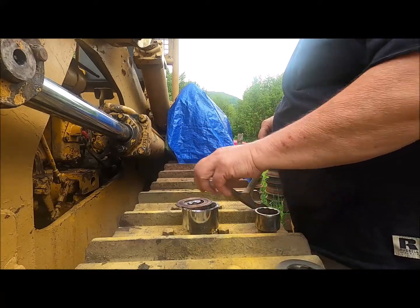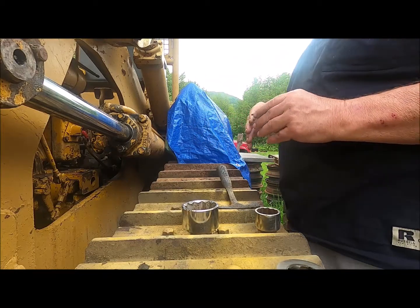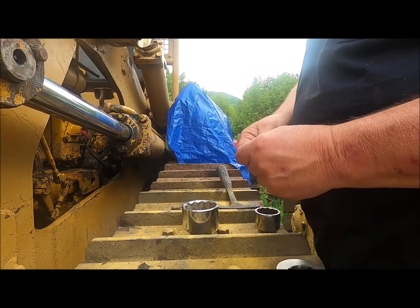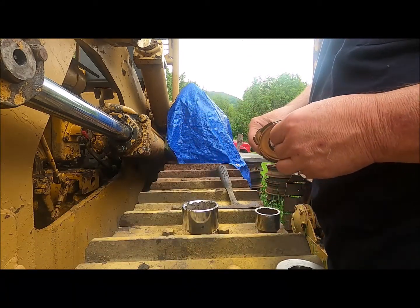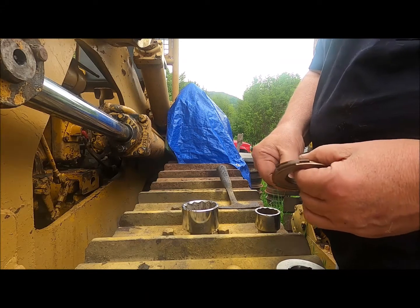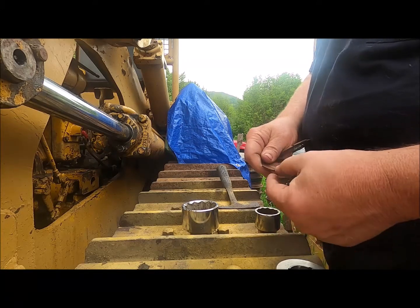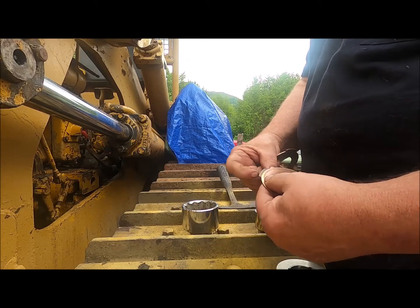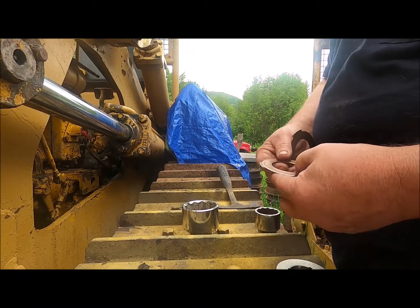There's a technique that Squatch 253 talked about, and it was beveling these brass plates. Now some of these got a little warm. When I got into it, the oil, I can barely feel anything. There's no lip there. Maybe a couple of thousandths. Most of this is on the edges, right here. This edge and this edge on all of them. I'm going to take a file and kind of knock them down.